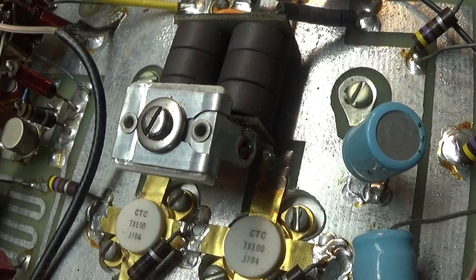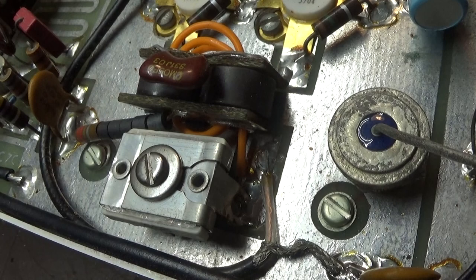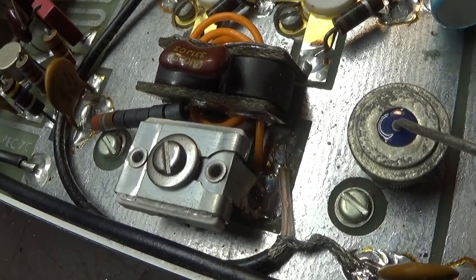What I really wanted to show is one of my pet peeves. This amp does have two trimmers: one for the output on that bigger coil, and then here on the smaller coil. Most amps don't have an input trimmer, but this one does, and some people don't know how to use it or what you're supposed to do with it. This is to trim the SWR coming into the amp.